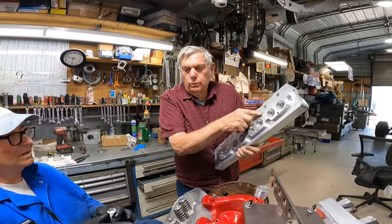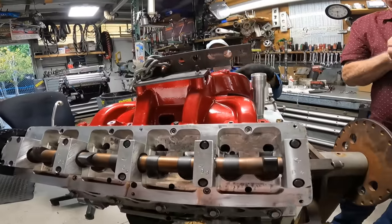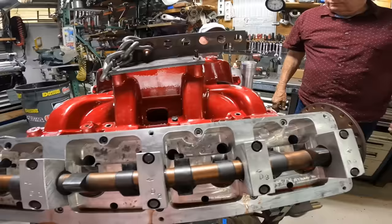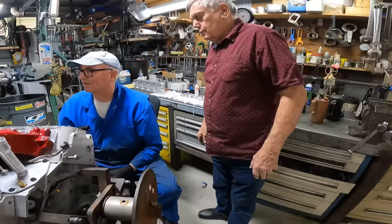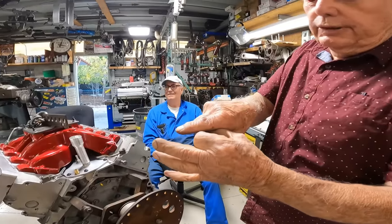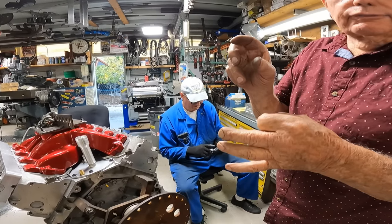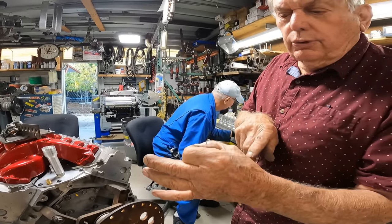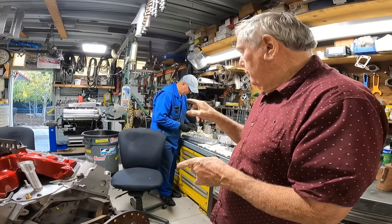On the LS, remember they didn't fully intersect the hole, so we had to put plugs in every one of them because they only do like half the hole. On older Chevys, you could just block off the back one, but on the newer LS the holes only intersect halfway. By putting a plug in there the oil still goes through. So we have to put an actual aluminum lifter bored out and we pound it into the block. That keeps the oil from bleeding out. So all the oil goes in the rear lifter bore, through a little plug, through a tube, into the cam box.